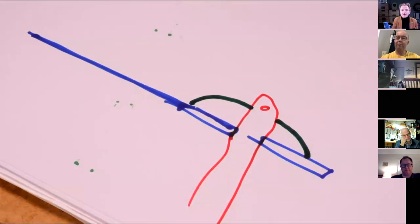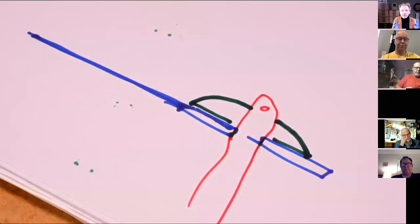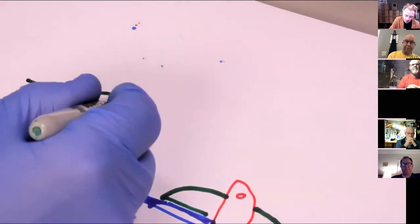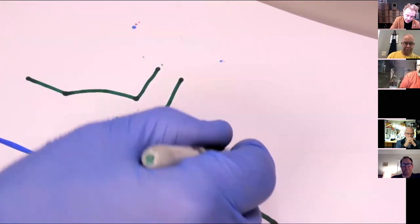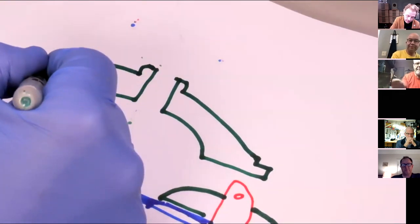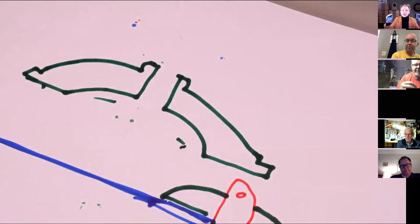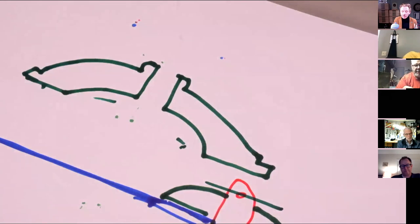I think some of the new ones I've seen, if you just part a piece off a brass bar, are solid on the back and it doesn't work properly. So if you're making them new, what you have to do is turn away a bit at the back. So you've got this space here, and then it'll sit at the outside edges and push the hand down. As we've said many times, really important that the collet fits right up to the pin.